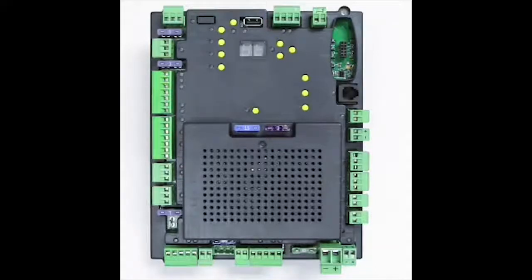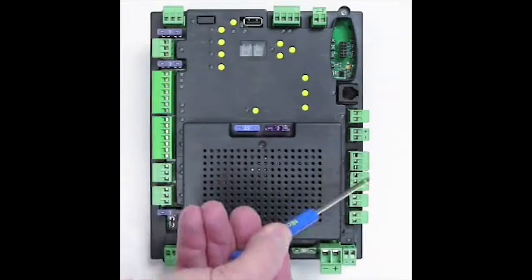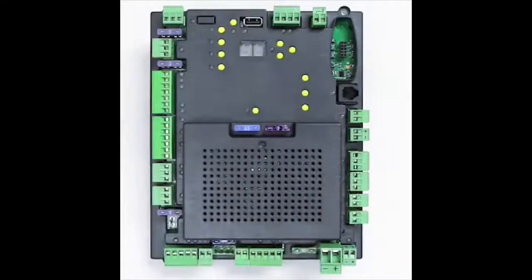The output side of the board is comprised of four connection points. These two — solenoid lock and alarm — are easily programmable to meet site requirements. The two 3-terminal ports above are open and closed, single-pole, dual-throw relays. Each of these outputs acts on the cycle respective to its name. The red LED to the left of these, as well as all those beside outputs and inputs, will illuminate to give visual indication of engagement.